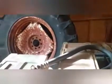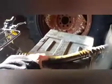After getting out the hose, so this is the return hose for the main flow back. It's a 25mm one. It's got a little pinhole in it. This hose here doesn't leak, but I need that hose but double the length, because that hose connects to that fitting down there, along with this small hydraulic hose up here, and it comes down to here, and then it has a piece comes up, and then it used to go into the oil cooler.